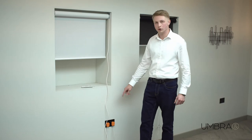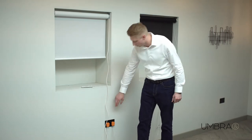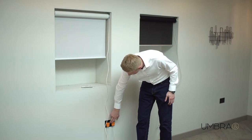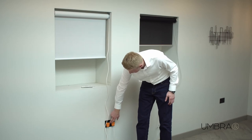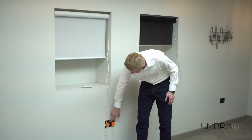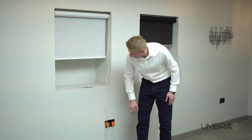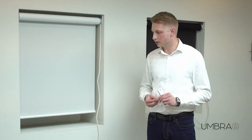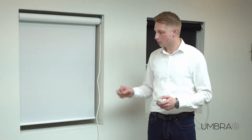Let me demonstrate. The power is currently turned on, so I'm going to turn it off — counting four seconds — then on for eight seconds — then off for four seconds — then power back on. The blind is now travelling for five seconds in the opposite direction, and it's stopped by itself.